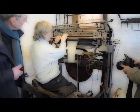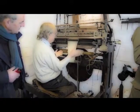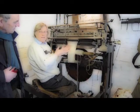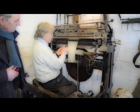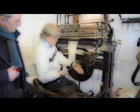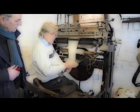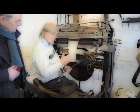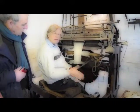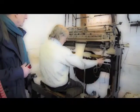First part of the process is to take the yarn, carry it across the needles. As it goes across, the jack sinkers will descend as it goes past them, and that will form a loop. If you imagine two needles, jack sinker will descend just there and pull a long loop. Fixed sinker will be there, that will stay in place. Another needle, jack sinker will descend, so you'll have a loop between every two needles. Let me just get to that stage first.